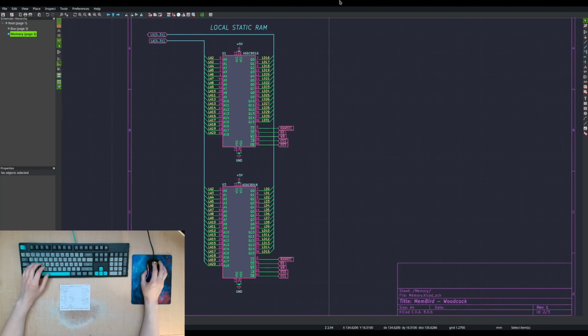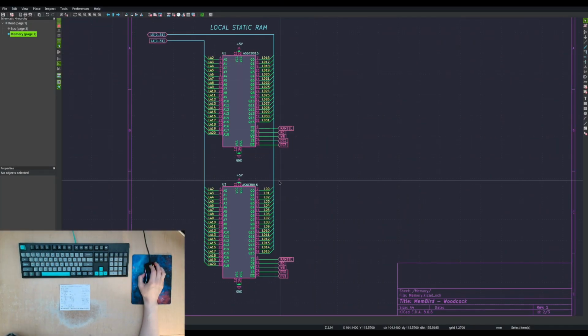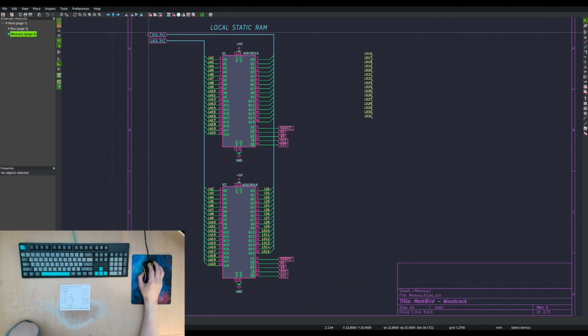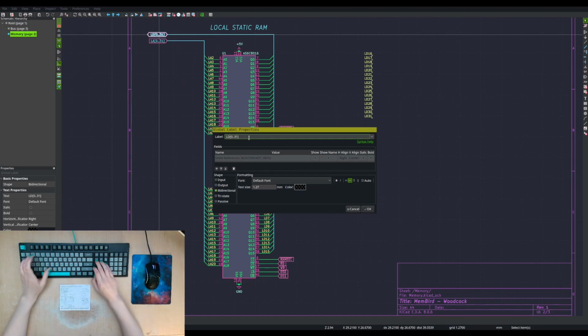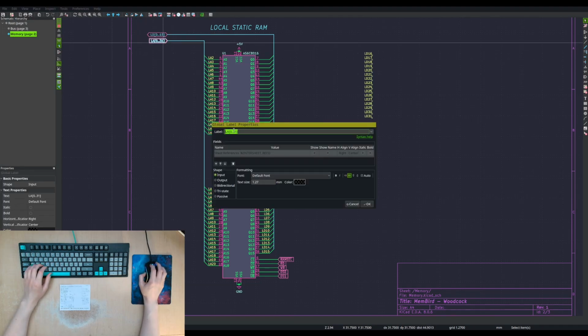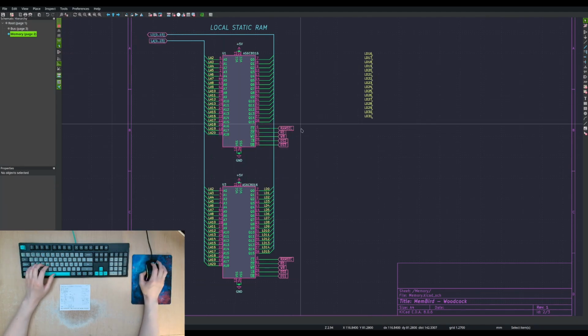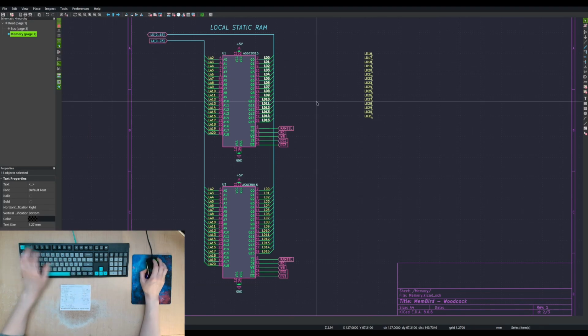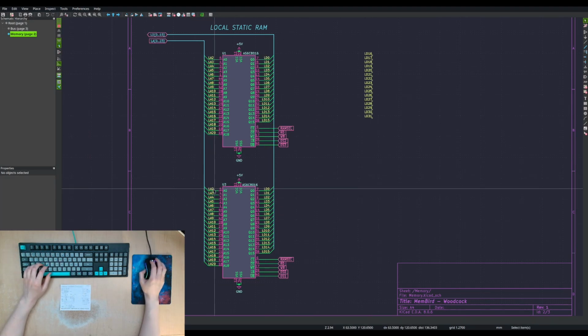So we're going to be doing a 16-bit card, so we only need the 16 bits. In the case of the other ones, these pins don't actually exist on this chip. So this is actually incorrect. This should be 15 because we've only got those 15 data bits on this. And the address pins as well. We've only got 0 through 23. But we're going to have multiple chips, so rather than delete those ones, I'm just going to do that. I will revisit the address here.